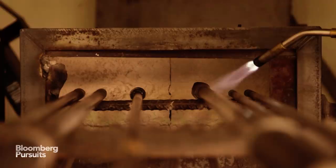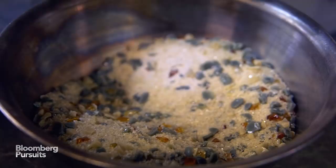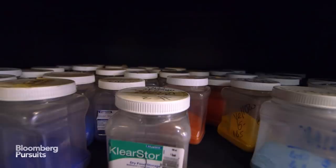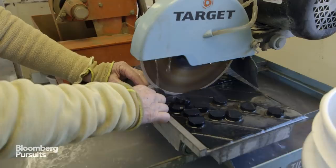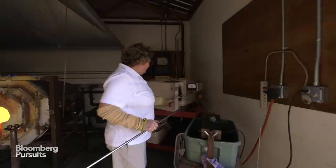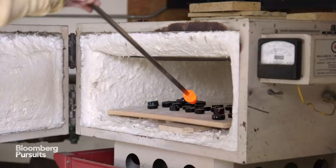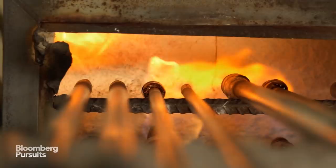After I've got the equipment coming up to temperature, I need to prepare my color for the day. Most people think the color is a paint — it's not a paint. It's actually colored glass that's been formulated by chemists. It can come in powder, or it can come in bar color, which can be sawed up into chunks for me to preheat in the color oven. One aspect of colored glass is that when it's hot, it looks black. So we need to know where all the colors are, and they have a specific slot in the pipe warmer.